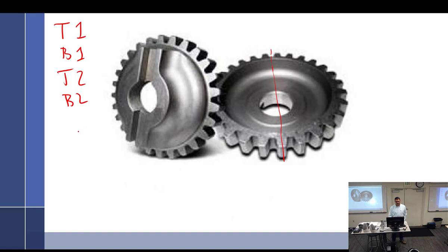All right? You'd never have a harness that has a T1 and a B1. So somebody laughed, you got it. Because one cylinder is going to have a 1, a 2, a 3, and a 4. You can't have 1, 1, 2, 2, 3, 3, 4, 4. All right, so on the nut, it will usually have something like that. That one goes in the top of number 1, and then maybe the next one says this, and that goes bottom of number 2. Okay. Trust but verify.